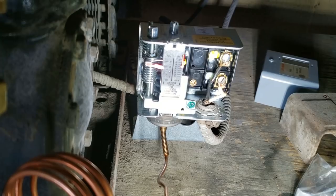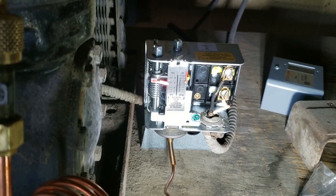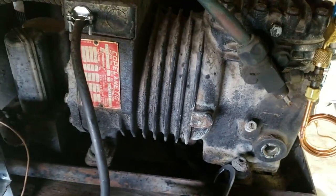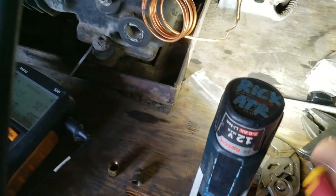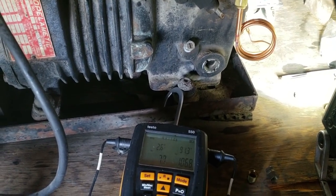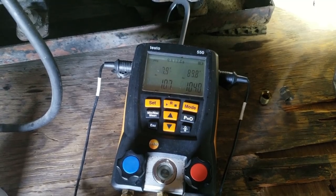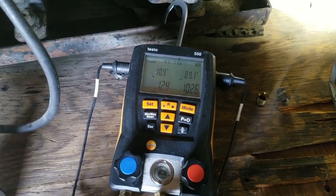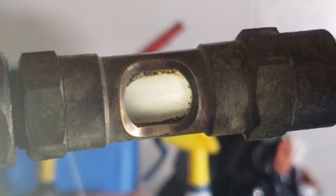So I've got it cutting in about 25 to 28 area, which is about 33 degrees. And you could get it all the way up to 38 if you wanted, but I don't like taking a chance. So we're kind of valving it off and making sure she pumps down. Unfortunately the control is a little faster than the gauges are. It's actually holding down there around 5, so you may have actually gotten it there. Kind of a cool old-fashioned looking sight glass.